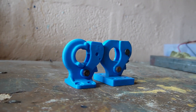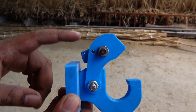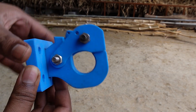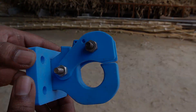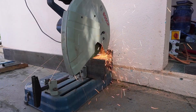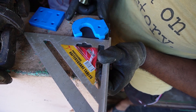We'll be using this modified design that I created using CAD. This is the part where the actual trailer hooks onto the bike. It has a built-in safety where if you don't release the safety lock, you won't be able to unhitch the trailer. Usually these are cast steel parts, but since I don't have a foundry yet, I thought I would fabricate it with plate steel.